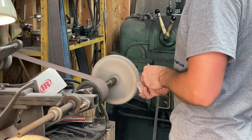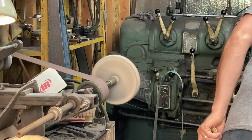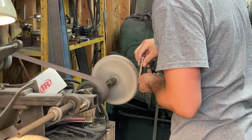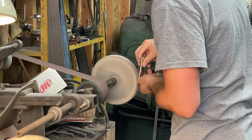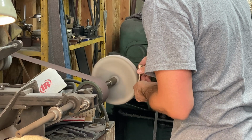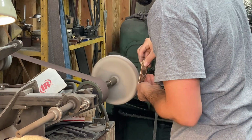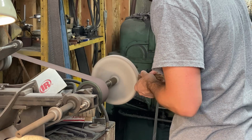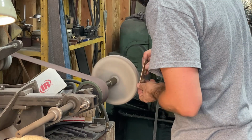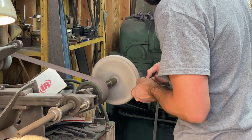I don't think you guys have seen this buffing arm before. This is on my old shop-built grinder, and some newer companies like Bogdan and stuff are offering these grinding belt driven buffing arms, but to my knowledge, I am the original inventor of this, at least as far as I've seen. The hardcore grinders did have a buffing arm feature, but those follow the Burr King model, where contact wheels and whatever else mount on an arbor that is V-belt driven by the machine. But this is the first tooling arm grinding belt driven accessory arm that I've seen.